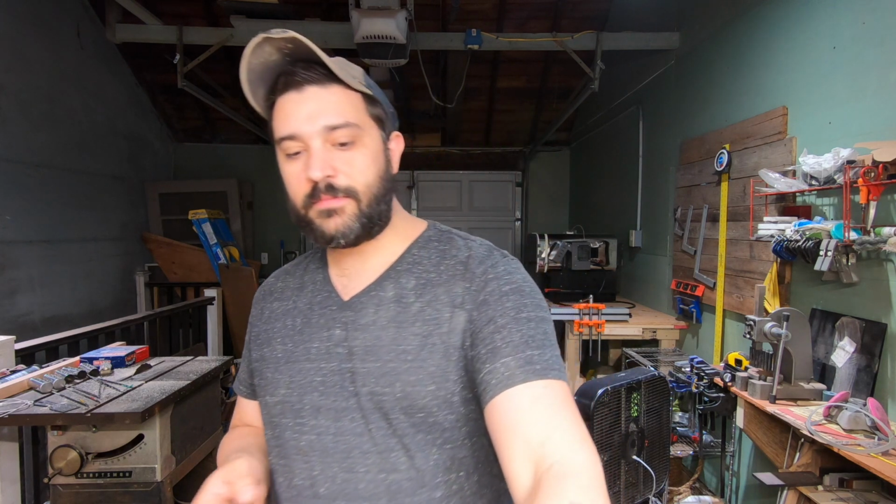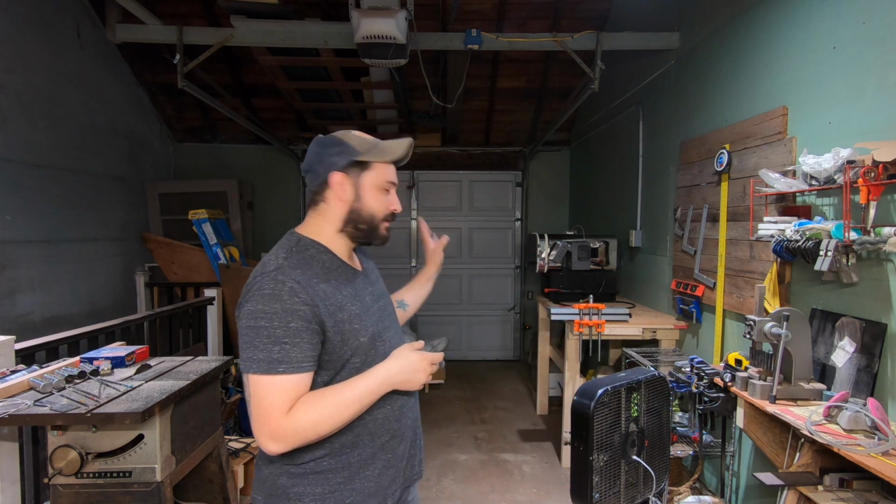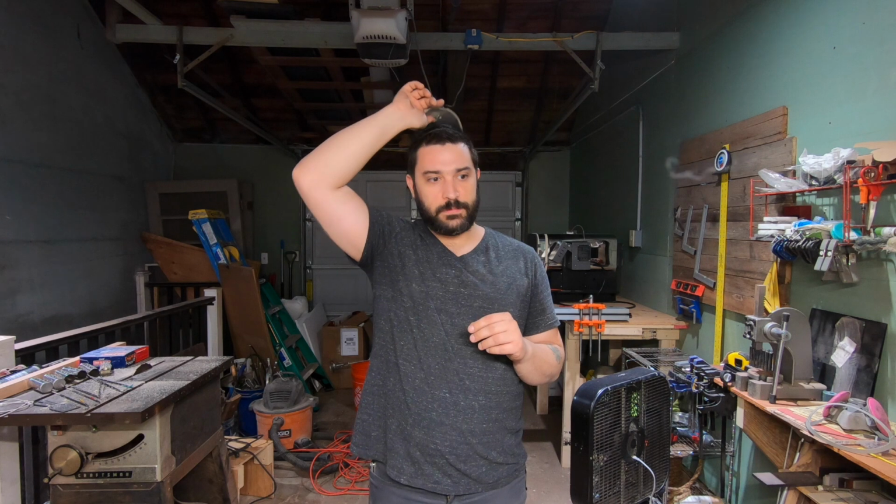So I think the next run of K390, because obviously this is going to be my first test, and there's already people hitting me up for some of these knives. I ordered a bunch of K390, trust me. A 23 by 6 inches of K390. We got a lot of K390 coming. I'm going to run at least 4 more tests on little coupons, get my curves down, and then get these to where I want them at that 65, 66 range. So I know it's possible, but that's what we'll do.